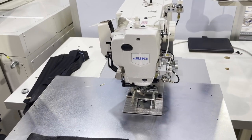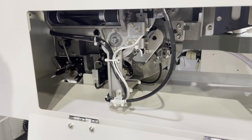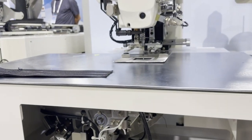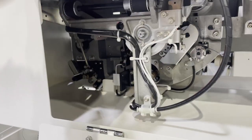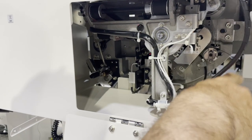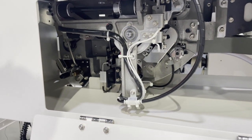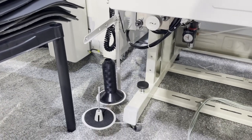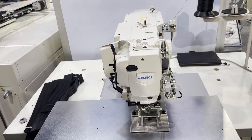The AW3 device is a bobbin changer and bobbin winder. You work with two bobbins — one on the hook for sewing, and one on standby. When the thread runs low, the machine has a sensor that detects it and automatically changes the bobbin so you can continue working. It then takes the empty bobbin from the hook, pulls out any remaining thread, and refills it directly from the spool. You never have to manually change the bobbin again.